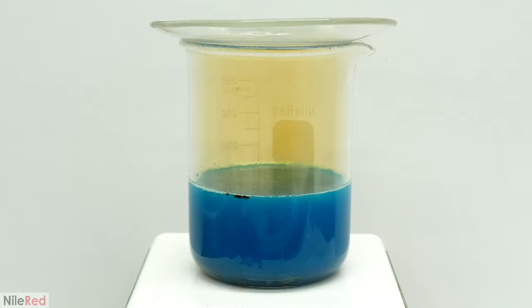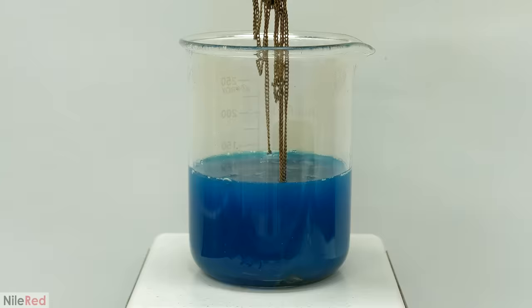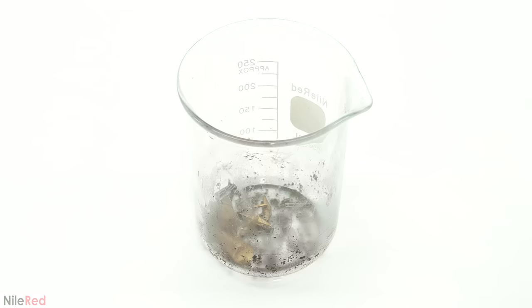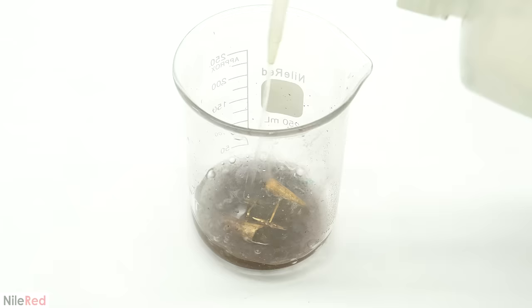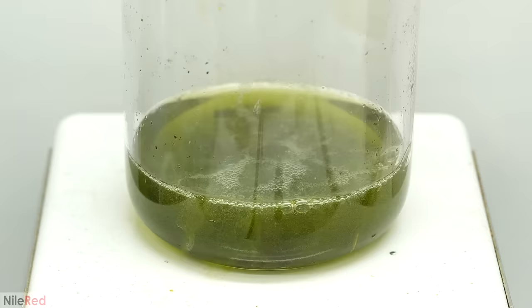I then added the liquid from the test that I did earlier on the piece of that small chain. I also added the full chain itself, that was most likely just copper and silver. This was all boiled for a couple of hours, and when it stopped reacting, I figured it was done. I poured everything off and I washed the stuff at the bottom a few times with distilled water. It looked like almost everything had dissolved, except for some of the stuff that was completely plated with gold. Then just like before, I poured in hydrochloric acid, waited for it to boil, and added small amounts of nitric acid.